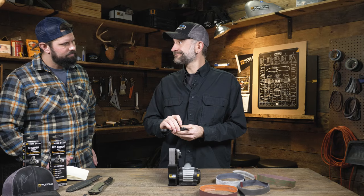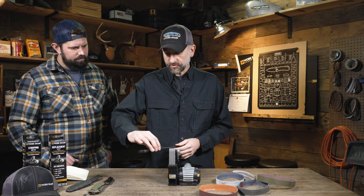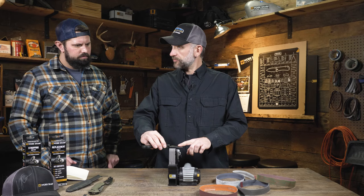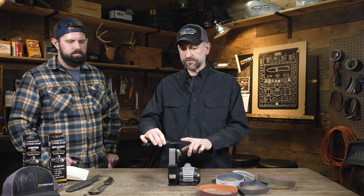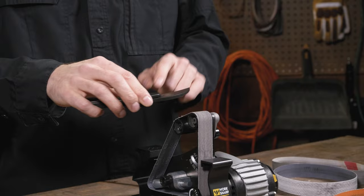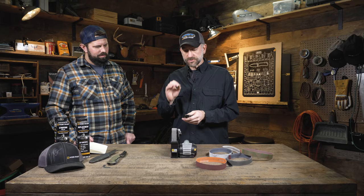All the same rules apply. Place the knife and come around and stop on the tip. You can see I have so much access to get around that curved edge on the karambit. One thing worth noting — staying horizontal is key. When we start on the reference plate, we want to stay horizontal when we sharpen. Having two hands on the knife gives me better control — it helps me stay level, and I can feel when I start to wander. It also gives me a fulcrum. On a different shaped blade like the karambit, I'm keeping horizontal and idling around. If the knife goes the other way, it gives me a perfect fulcrum to pivot the knife — slow, steady, controlled motion as I'm traversing across the belt for really consistent results.